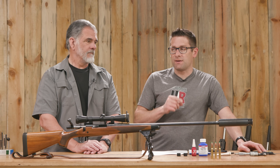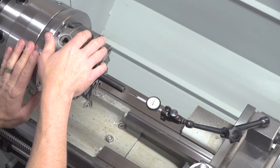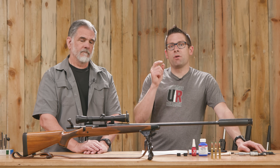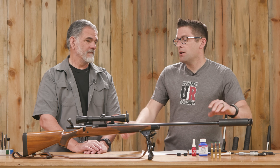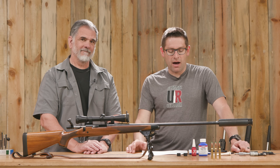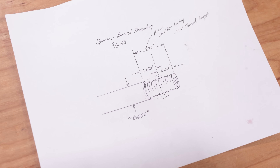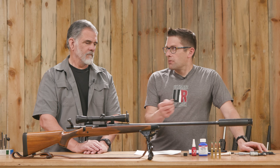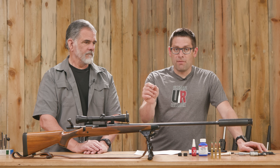Typically I would use the SSG range rod but I didn't have the right size bushings for this, so I used an indicator. We went right inside the bore — near the muzzle and then in about an inch and a half — to get two different readings, adjusting the axial and radial adjustments until we were within about two ten-thousandths of an inch, which is plenty good for a muzzle threading job. I also drew up a diagram to calculate exactly how long I needed to thread the tenon so that I had the thread protector screwed on and Loctited in place, with about .610 inches of threaded muzzle total.